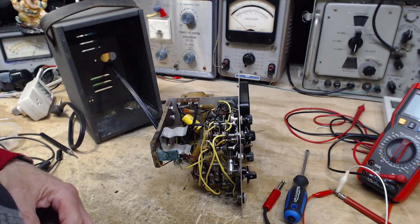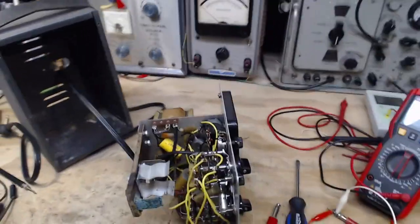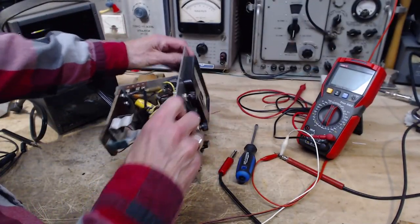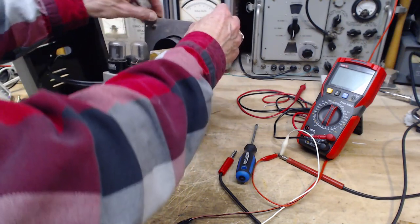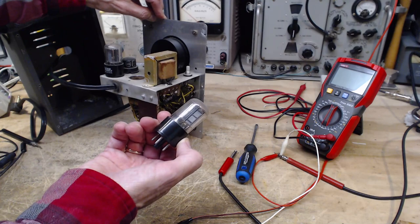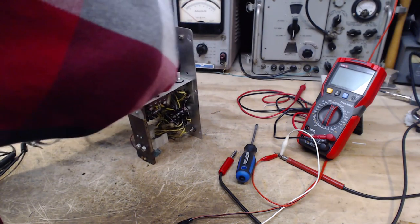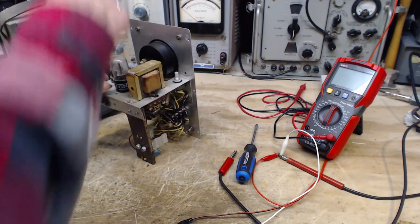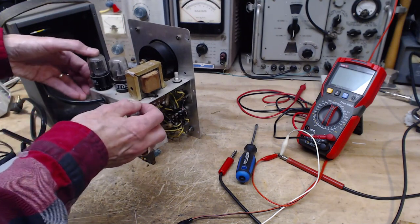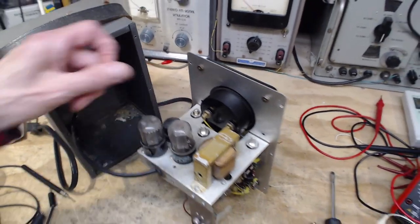While I'm talking I'm examining everything here, trying to spot anything curious. There's a large wattage resistor back here which looks just a little roughed up. I'm going to have to find a service manual because there are adjustments which probably need to be made. What about these tubes? One of them looks like a rectifier tube - little short guys. This is a 6X5. These are not common tubes, and that's something about these kinds of instruments - they're liable to have tubes which are not common to radios. There's also a 6SN7 - a very common tube - the amplifier tube. And a 6H6, a small diode tube.